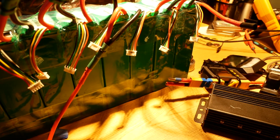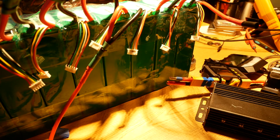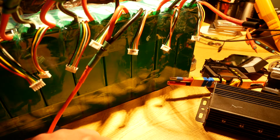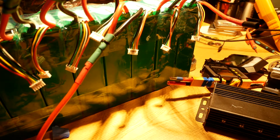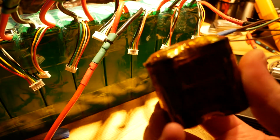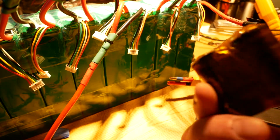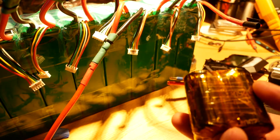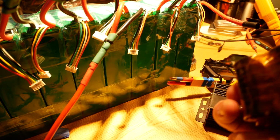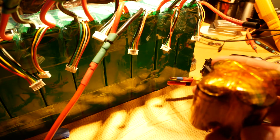So what I'm going to do is show you a couple things, and this is one of the problems with these wheels and how they are built. I'm going to simulate what happens. This right here is a bank of four 1000 uF capacitors. My Gotway M10 has two 1000 uF capacitors in it, so two of these rather than four. But nevertheless, you still get the same result.